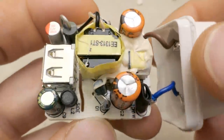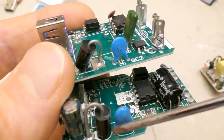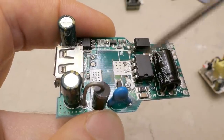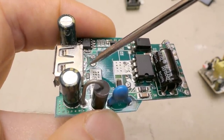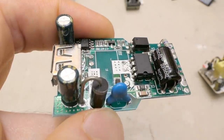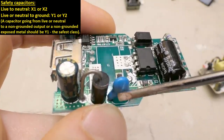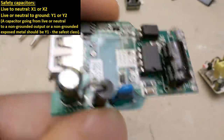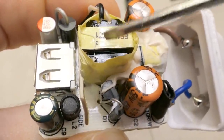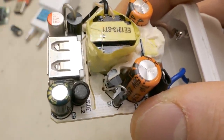It also has no interference capacitor going from the primary side to the secondary side. The other ones usually tend to have a capacitor between the primary and secondary side — that capacitor reduces the common-mode interference going to the output, because the high-frequency high voltage on the primary is capacitively coupled into the secondary, and the capacitor provides a return path for this current back to the primary side so it doesn't reach the output. However, those capacitors are critical for safety, because if one fails short-circuit the mains voltage gets to the output and you can get an electric shock. But this one doesn't have that capacitor.